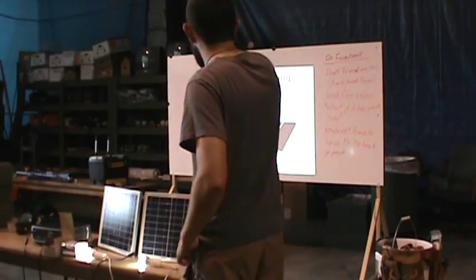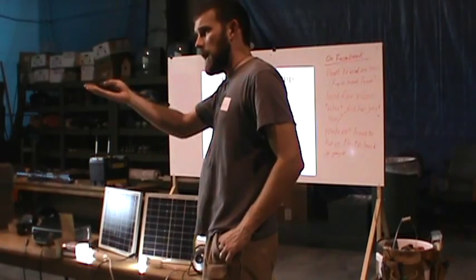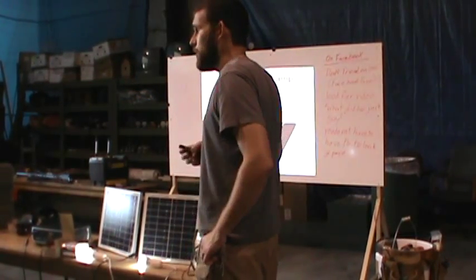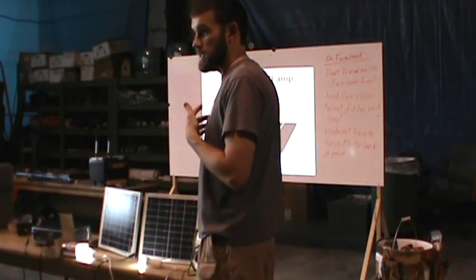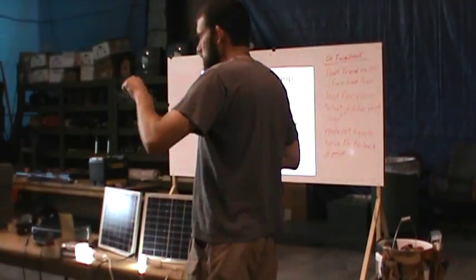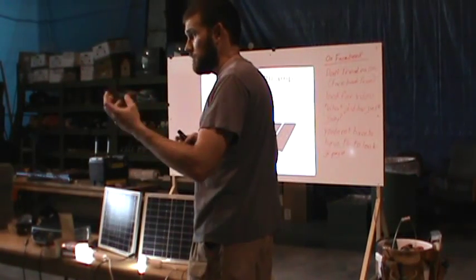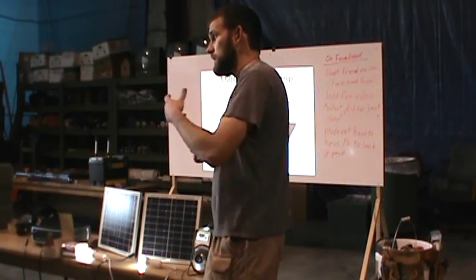It has waterproofing plugs. So if you don't want to go with the electric company grid tie or anything like this, you buy that and you have everything you need for off-grid power up to 1500 watts, 20 amps. So don't max out over 20 amps and don't max out over 1500 watts. There you go. And if you get some DC water heater elements for your water heater and a DC powered water pump, you hook that on, you still have your heated water.